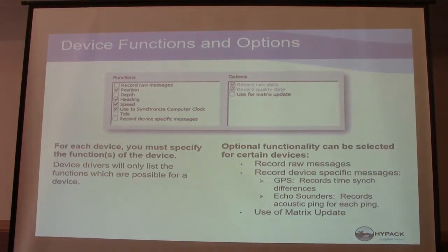If you blindly leave everything checked on all drivers, in the RTK scenario you'd be recording depth and tide from your GPS. What's going to happen is when you go to the single beam editor, it will populate the echo sounder field with your GPS because it's a depth device. You'd be trying to process it and your GPS would be your position, depth, and tide — which is really going to be funky. When you call tech support we're going to figure out that in the parameters, you need to make sure you have the right echo sounder chosen. GPS really wasn't an echo sounder — you just left it checked.